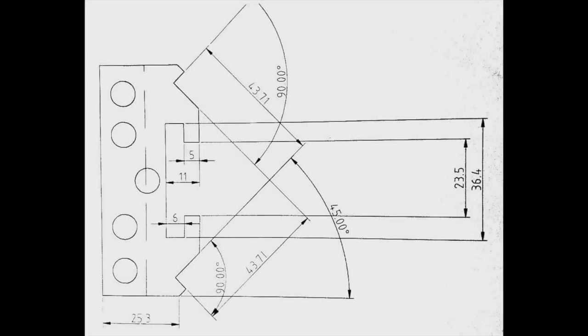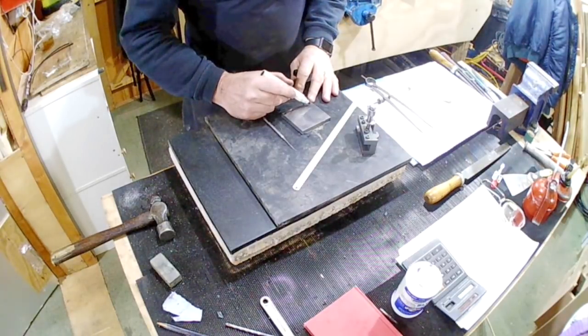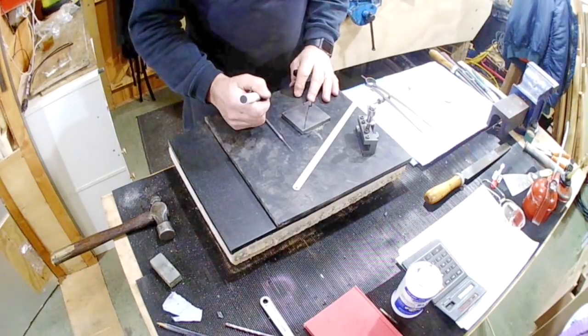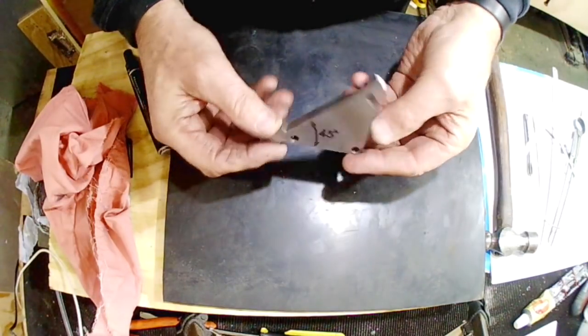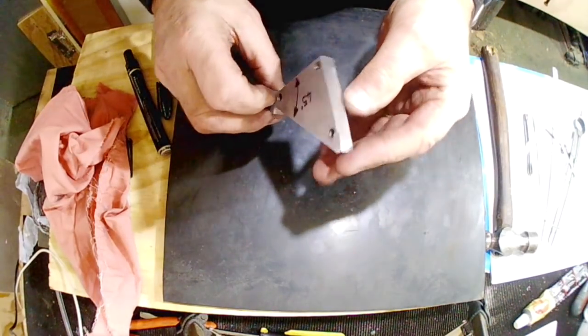Here's a drawing of the tool holder showing the most important dimensions as taken from the best fitting one that I had. First things first, I had to make a setting fixture so that I could sit the proposed new tool holders at 45 degrees in the various machine jaws. You can see it's made with stops on the hypotenuse and the adjacent intersection to aid repeatability and sampling.